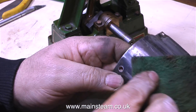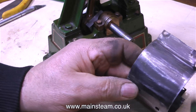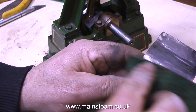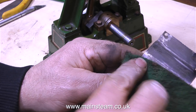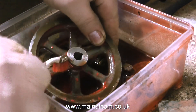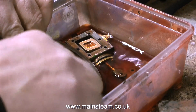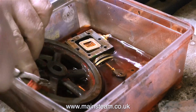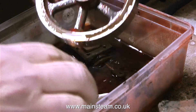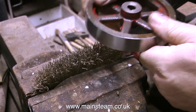It was going to take too long with scotch-brite, so I moved to emery paper - coarse grit first, working down to wet-or-dry sandpaper, which made it much smoother. Moving on to the pot of cellulose thinners: the paint has more or less fallen off the flywheel but the varnish is still there. Whatever this varnish was, it was very good at sticking to the metal but not very good at protecting it from rust.